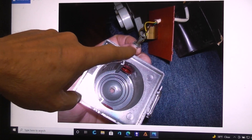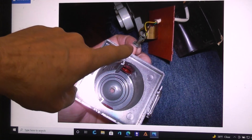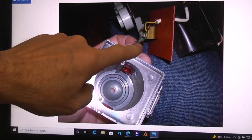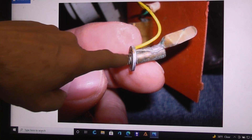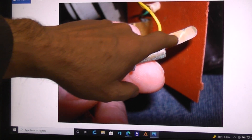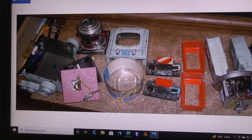Looking down inside the head, once you remove the fiber board: this piece I'm holding would normally go up in here and be held by a nut on top of the robot where it's threaded. When you stick the antenna in, it makes a contact, and when it goes all the way down it closes the circuit. I had to find a nut to fit those threads — the original was likely perfectly square, but I found one that fits. It looks like someone had previously kludged in a wiper contact to ensure the antenna sliding through the pipe would complete the circuit.